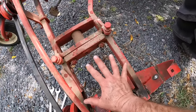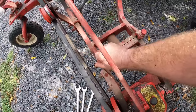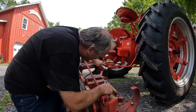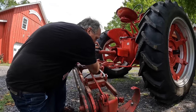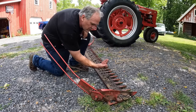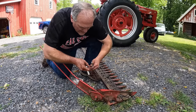See how the front end is riding up? We really want it close to horizontal. To change that, I've got these two bolts here which will rock this whole assembly one way or the other. I need to tighten this one down and loosen this one up. Guys who used to cut with sickle bars knew how to adjust them depending on cutting conditions — horizontal works fine for me, though sometimes you want the bar angled up or down a little. This bolt is stuck, but I've got it about where I want it with just a slight upward tilt in front, which I'd much rather have than a downward tilt.